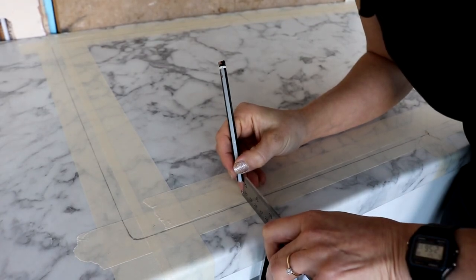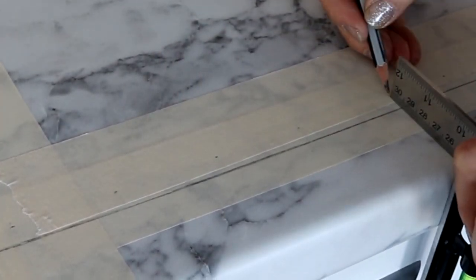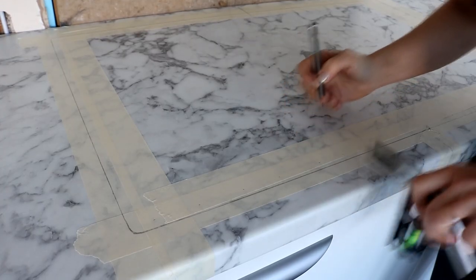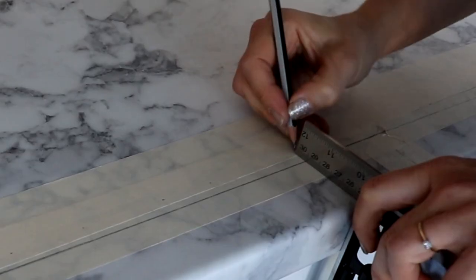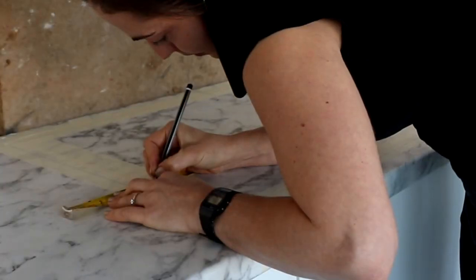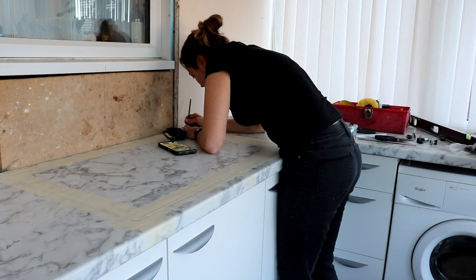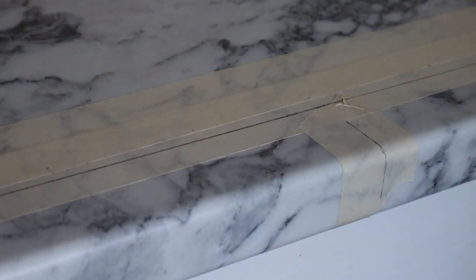I needed to make another pencil line inside the first one, following the instructions to 10mm inside. To get 10mm inside the square I set my set square to 60mm instead of 50mm and marked intermittently with a pencil. Away from the edge I just used a tape measure. I then turned those marks into a straight line using something long and straight — my spirit level.